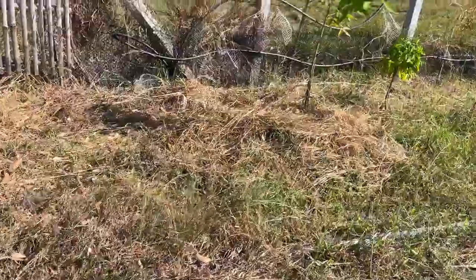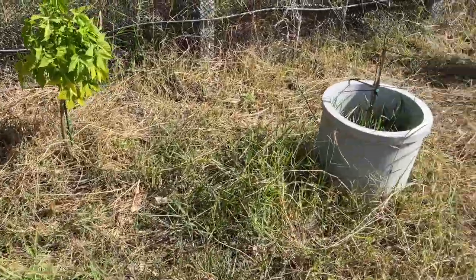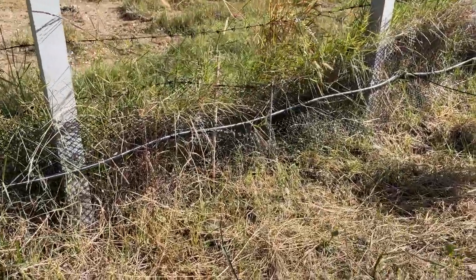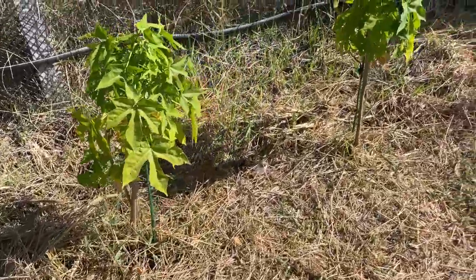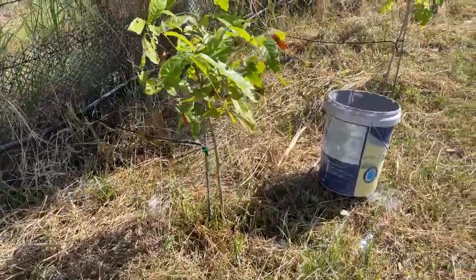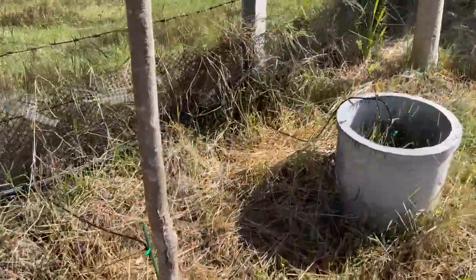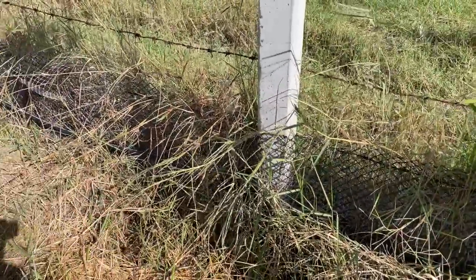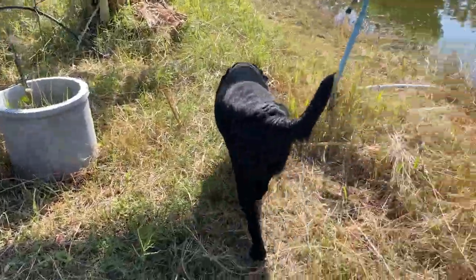You have to keep monitoring these things. The pipe has just basically popped off due to the pressure — at the end of the rainy season there's an awful lot of water and we end up with a lot of pressure. It's probably one of the green taps that doesn't have barbs on both sides — so a bit of work required.